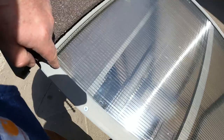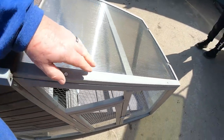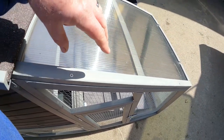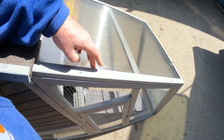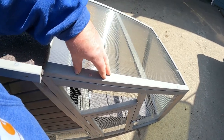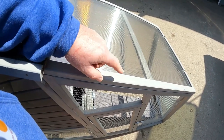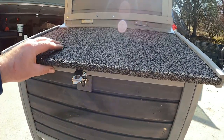I would probably use a paintable silicone because this is just a very light primer. You're going to want to silicone all these screws so water doesn't get in there and start swelling this stuff up. So basically use a paintable silicone or paintable caulking, seal up all your edges and screw holes, and you're going to want to paint this with a good outdoor exterior paint. This primer they have looks good and appealing, but it's just like a light stain, and I'm not sure if it has any waterproofing benefits.